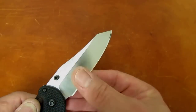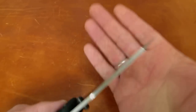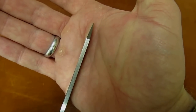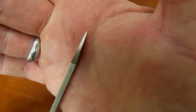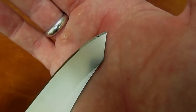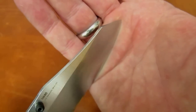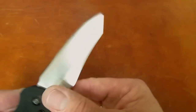There she is. I did this on my two-inch jet belt grinder and I think I did it with pretty good symmetry. I'm sort of at the mercy of Benchmade's factory grind, but I think I got it pretty good and matched the texture well from the reverse tanto tip to the main spine. I broke the edges just ever so slightly with the medium rods on my Spyderco Sharpmaker, and I think it's just about the same edge break you get along the main spine.